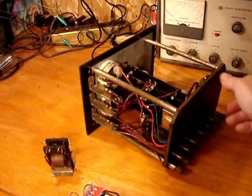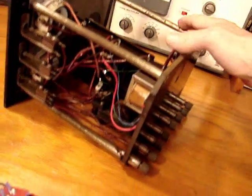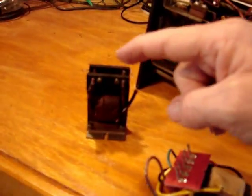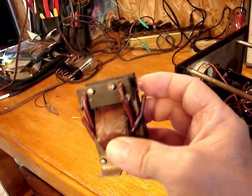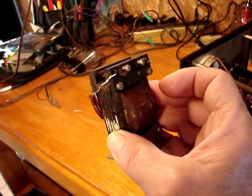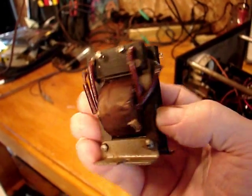Here is the RADA apart. You'll notice that I've soldered in a replacement transformer for this. This has an open secondary. The primary measures 21K. So this transformer must have had very, very fine wire wound in it.